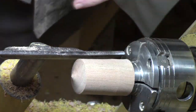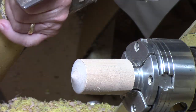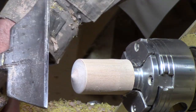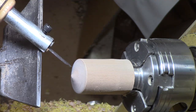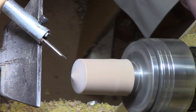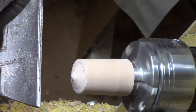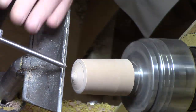I've got a pretty nice finish off of that cut so I'm not going to bother to sand it — though I could probably touch it up with a little 400 grit. Now you can decorate these with a lot of different tools; you could just use a felt-tip marker and not do anything else. But I'm going to use a chatter tool. This is a fun thing when you're demoing because people enjoy it — kids really enjoy this because it's kind of exciting to hear that squeal. We're going to come down somewhere in the middle, get the speed up to 1,500 to 2,500 RPM, and go from the center down to about 7 o'clock. We've got a nice pattern. I like to separate that pattern just a little bit where it changes to define it a little better — so I'm just going to put a mark there, mark there, a little bigger mark there.